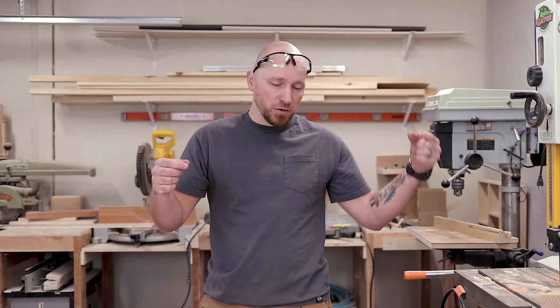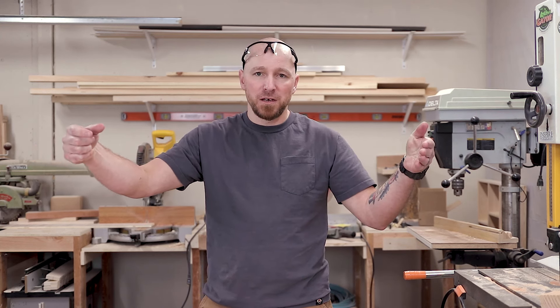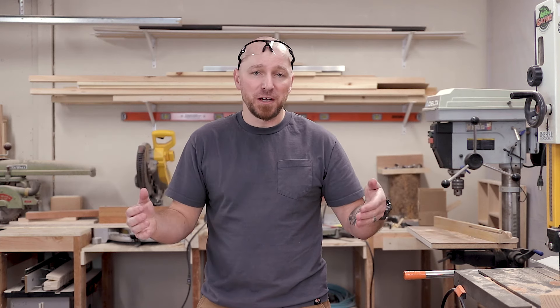Now we need to set ourselves up well to begin with. Seasoned woodworkers know you need boards with squared, jointed edges. But what I see a lot of newcomers and early DIYers do is not square up the ends of their construction-grade lumber and fence boards before pulling their measurement. A lot of times the end is not very square, so when you hook your tape and mark out 12 inches at one edge, then mark 12 inches at the other edge, you still get 12 inches — but it's just copying what the un-square end does, so your mark ends up in a different spot. It's a very good idea to square up that end first.